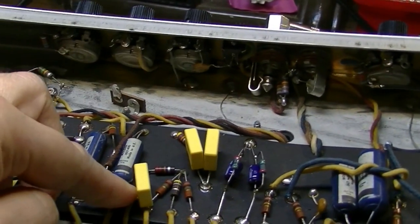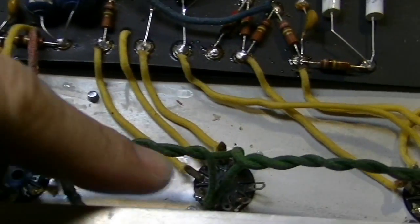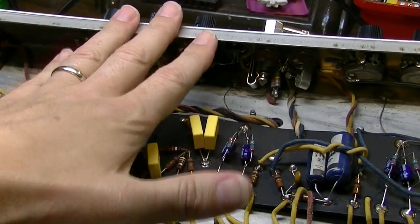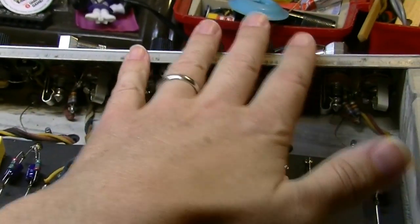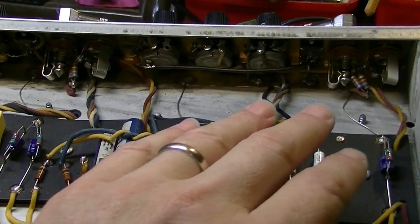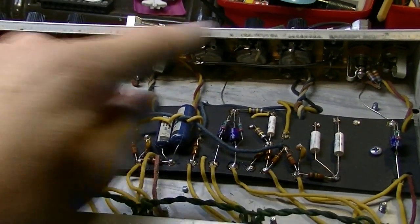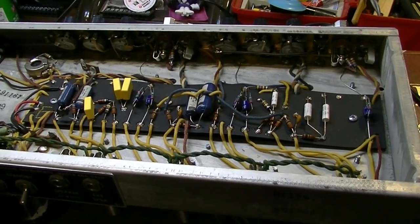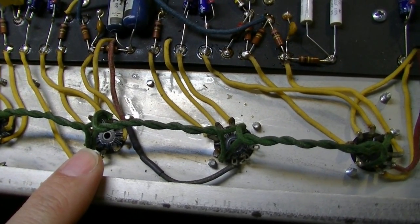On the second channel, we are going to revert it back to Fender stock, but we're also going to add this additional gain stage. So basically he'll have a souped up normal channel that still has the Fender tone stack, and he'll have the bass channel, which will be turned into a Marshall JTM45 tone stack. So he'll be able to jumper these channels if he wants also, to give him more flexibility. And if he gets an ABY pedal and goes in the front end like that, he'll have the choice of either or both.